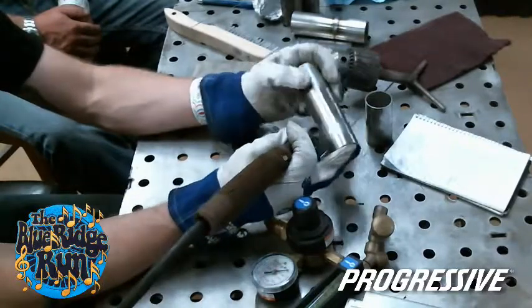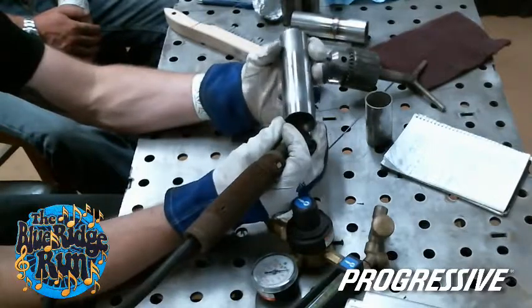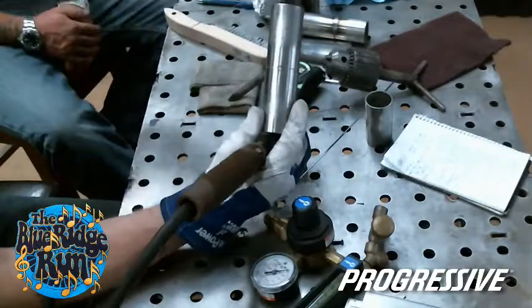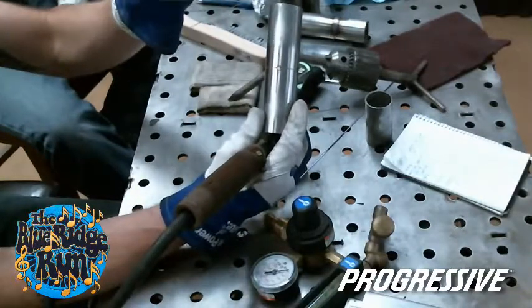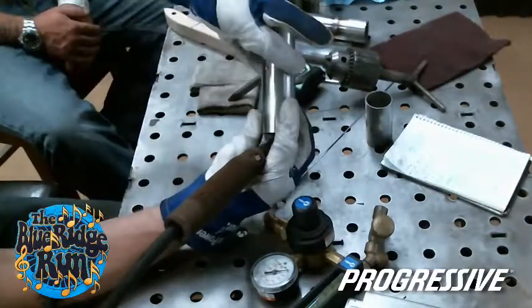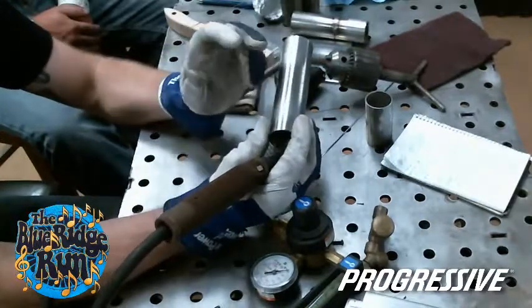So you'll just do that, like you're saying, multiple times around this piece. Yeah, and they're not strong tacks. Right. Like if I was off a little bit, say I'm coming right out of the head, pop it back and off. It's two pieces. Yeah, I can just either hit it with a hammer or wiggle it. Wiggle it on the sides that don't have the tacks, and it'll just snap right back off. Then you just have to clean.